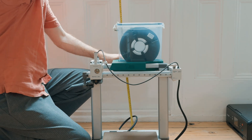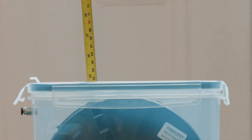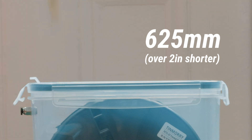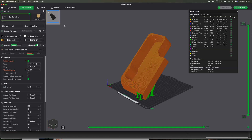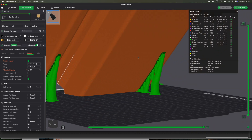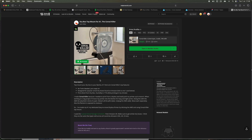Now the cereal box sits about 50mm lower — that's a pretty decent space saving, especially if you're height limited or printing inside an enclosure. Both brackets are designed to be printed at 45 degrees so they don't need much support material. I'll put these files on Maker World for anyone who's interested.